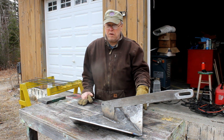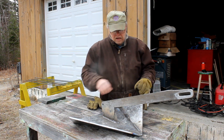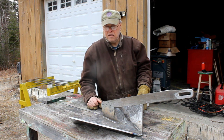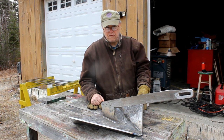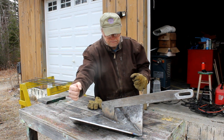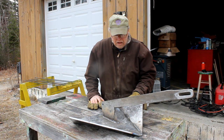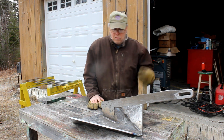Going into next week, depending on the weather, I'm going to fire up my home-built forge. The reason for that is there has to be a roll bar that goes across right here. When I go to make the bend on the roll bar, the stock is a little bit too heavy to use my roller or shaper for doing round bar — it's for up to a quarter inch and that's it. I'm going to have to use at least a half inch or five-eighths. I'll make up a jig, get it cherry red in the forge, bend it around the form, and then weld it on here. Then there's a little bit of priming and painting, and the anchor will be essentially finished.